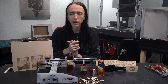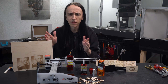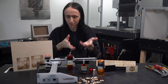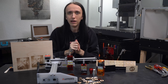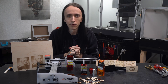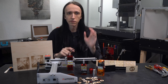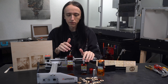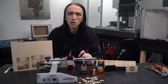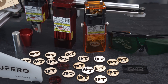In Lightburn, just make sure that you have set up the S values from 0 to 1000, as by default it selected 0 to 256 for me, which only gives a quarter of the laser power. I noticed after engraving a bunch of things that somehow the power did not add up — until I realized I was only engraving at a quarter power. But after adjusting, using the two high-powered ones is a breeze, and the cutting results are essentially the same as on the LM2 Pro, which is no big surprise since it is using the same laser.